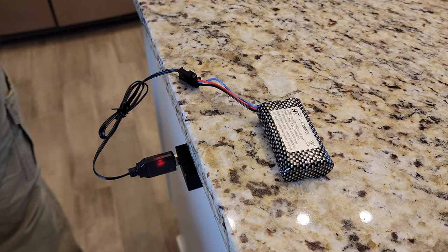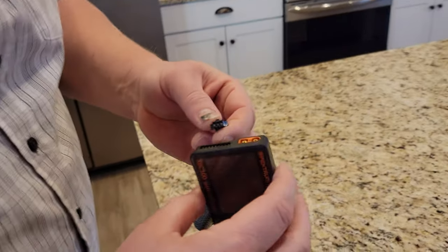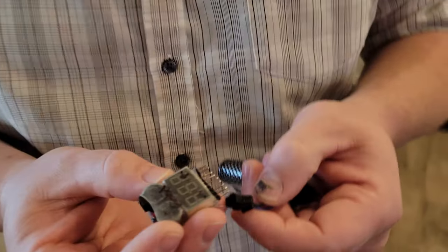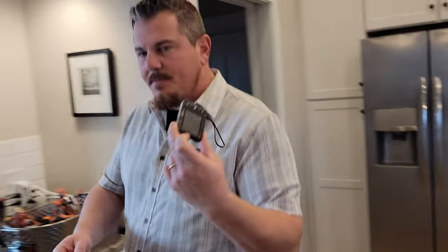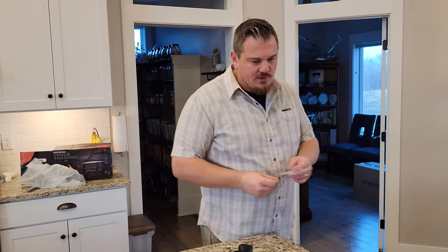It looks like it goes to a solid green light, so maybe it's already charged — we're going to let that run for a few minutes. Let's see if we can plug it into a voltage alarm. Our standard voltage alarm will probably reach into these pins — and we got 8 volts, so we're at 4 volts per cell. We'll plug this in while we work on getting everything built and let that charge. You can't use the XPC battery checker on it because it's not a Hextronics balance lead, but that is both the balance and discharge lead on this application.